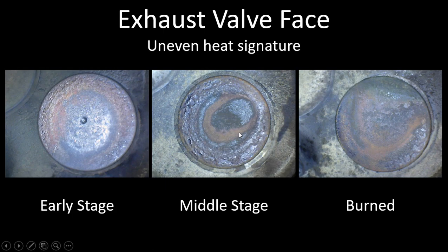In the middle image, the center of the bullseye has shifted further toward the edge of the valve, and the outer rings have become compressed. The outermost ring dissipates off at the top. That's pretty much where you want to limit yourself if you're going to take action like lapping a valve. If you let it progress much further, there's a risk of permanent damage to the valve that would make lapping not worthwhile. There's no published guidance available to tell you how far you can go before lapping — it's up to you and your mechanic to decide when and if that's appropriate, or if it's better to replace or send the cylinder out for overhaul.